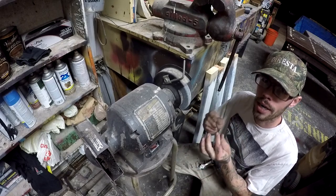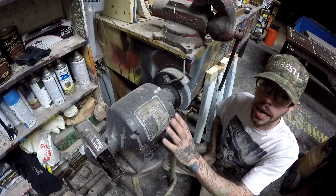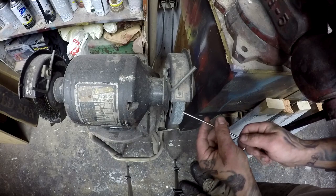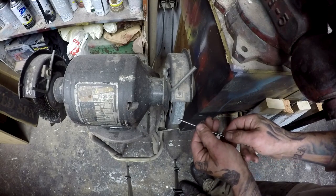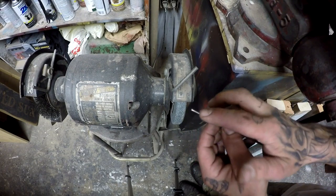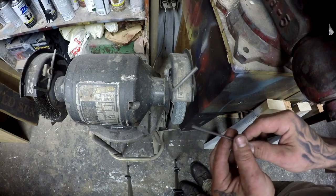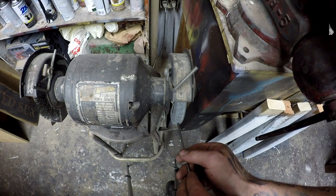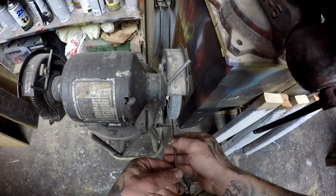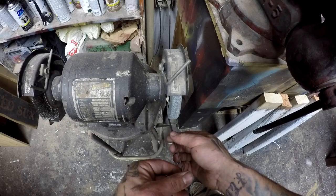You want to buy a dedicated brand new wheel that you will only use for grinding your tungsten. What I recommend — and what I've seen other welders do — is just buy a dedicated bench grinder for TIG grinding so you're not constantly changing out wheels. Now, it might seem easiest to just hold the tungsten to the side and grind it to a point, but grinding from the side puts a grain pattern going around the tungsten, and that's not the way you want it. The proper way is to come straight at the wheel and grind with the tungsten going lengthwise into the wheel. Also, do not breathe that dust — wear a mask or respirator.